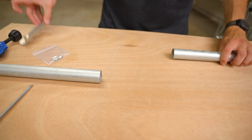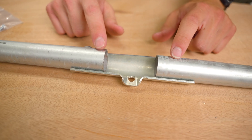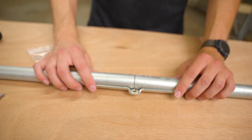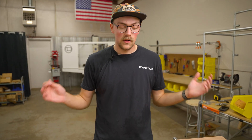For the one inch EMT, the difference is this coupling actually allows you to have the two pieces touching. So whenever you use the no lip inserts with a threaded rod, just make sure that they're completely touching, thread those together, and then assemble the coupling on top of that like normal. You can even add the self-drilling screws to go a step further and make this really reinforced. It's a really easy hack — hope you guys enjoyed it. If you did, leave a like and consider subscribing. We'll see you in the next one.